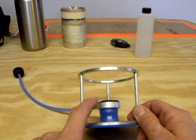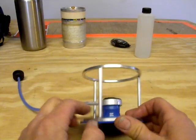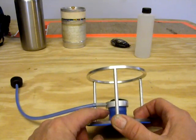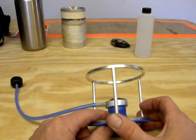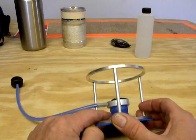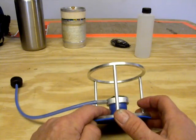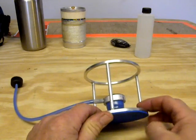Basically, this original top is twice as thick as this because on the ones that I sell, the nipple comes down here into a solid aluminum piece to get enough thread material to thread it in and have it solid. In the end, that three-eighths of an inch of aluminum that the nipple screws into is just solid aluminum — wasted space. No alcohol can get in there, so it cuts down on the overall volume of the stove and, in the end, the burn time.